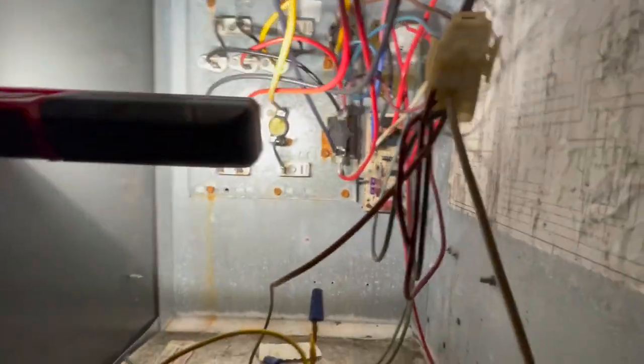You can see, well, there was some smoke coming out of the relay. So that blower board is no good. Let me make sure that our power's dead, because I've made that mistake before. Check everything to ground. Oh, wait, no, I'm sorry. I gotta check the backside. Nothing there, nothing there, nothing there, nothing there. Okay, so the power is dead. We most definitely have a bad blower relay board here.